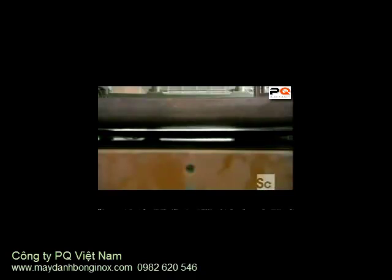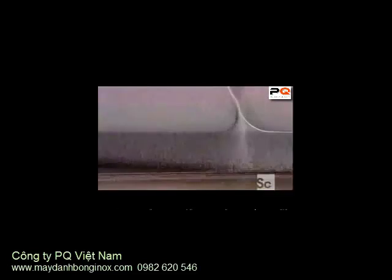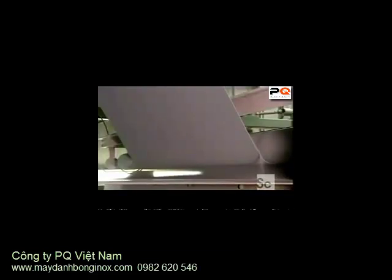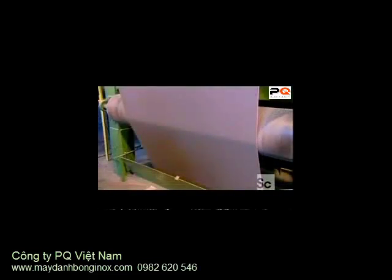The system generates an electrical field that triggers a mini sandstorm. Once airborne, the abrasive grains stick to the adhesive-coated cloth and become embedded in it. This method allows for even distribution of the grains across the cloth. The grain-coated cloth now rolls out of the pit and back up to the main level of the factory.